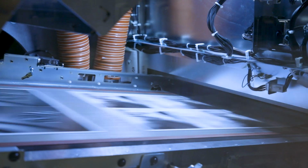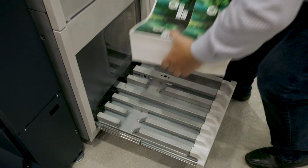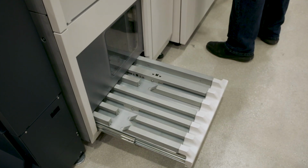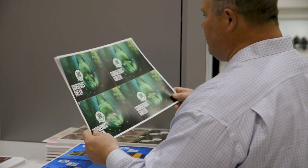The IX series high-capacity stackers can stack up to 6,000 sheets, delivering 3,000 at a time, that can be unloaded while printing. Up to 2 stackers can be supported, which can be addressed separately or linked together for longer unattended print runs. The unit provides highly accurate stacking for error-free post-processing of stacks. The HCS provides an open finishing interface connection to our third-party finishing partners. That is an important part of the many end-to-end automated solutions for our customers.